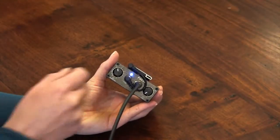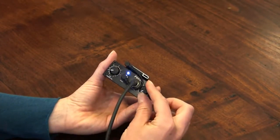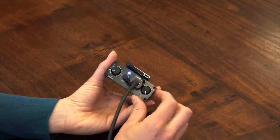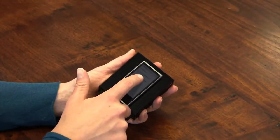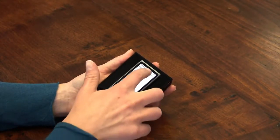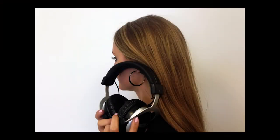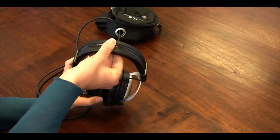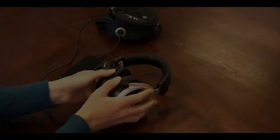To test the bone conductor, turn your air conduction volume as low as it will go without turning the amplifier off. Turn your bone conductor volume clockwise to 1. Go back to the headphone test playlist, select bone conduction test, and then select the BC test track. Hold the headband close to your ear to hear the music through the bone conductor. You may also pinch the bone conductor between your fingers. You should be able to feel it vibrating slightly. You have now confirmed that the headphones are fully functioning.